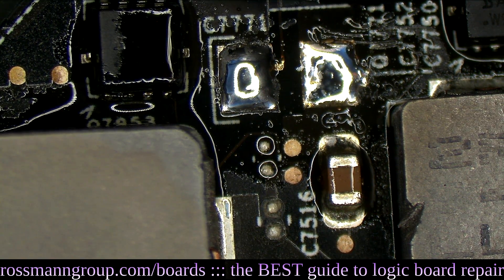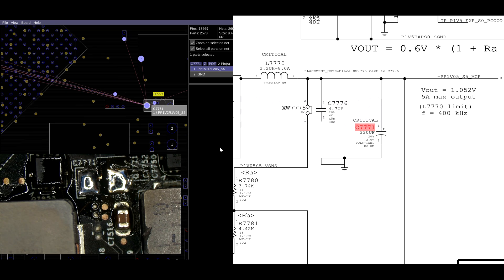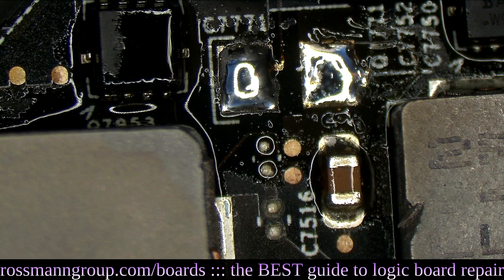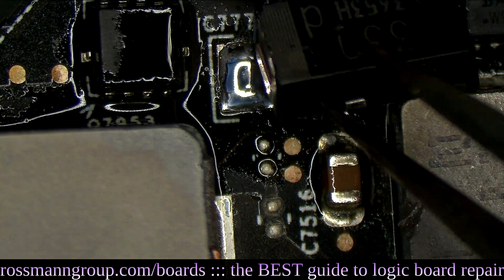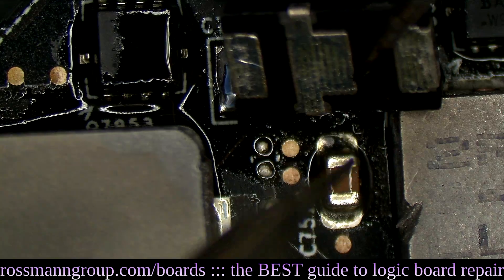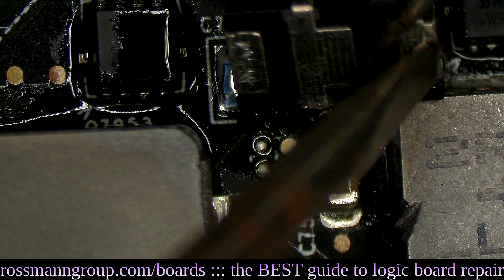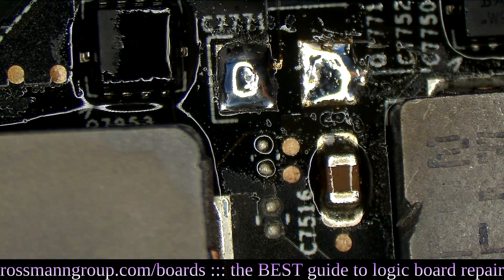As we can see on the schematic and board view, the left side of this capacitor is going to be the positive terminal — that's our 1.05-volt line — and the right terminal is going to be ground. Our capacitor has three pads and a bar; the bar is the positive end. We want to solder it so that this pad goes to ground and this pad goes to positive. Both outer pads are the negative terminal, which is cool because it allows me to fit the large capacitor where the small one would have gone.